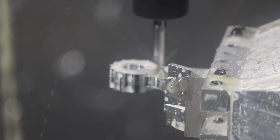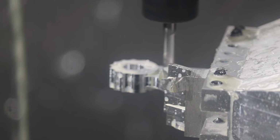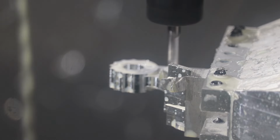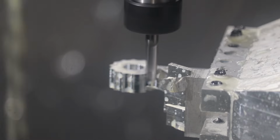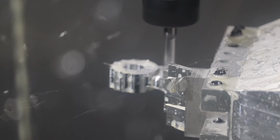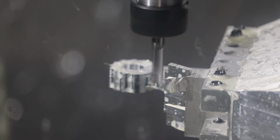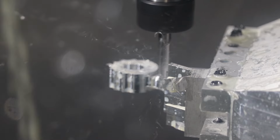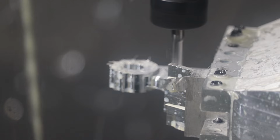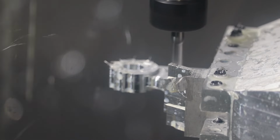Now for this operation, I didn't have to completely remove all of the metal, because with raster cutting, we're only cutting 4/1000ths, or about 0.1 millimeters per pass. So that's not an aggressive cut to cut away that original stock. But if I were to plunge into that, like on the other side, then I would have had to cut more of that stock away. Because end mills like to cut with their full face, like sliver cuts with the full face of the flutes. So it's just happy doing it like this.